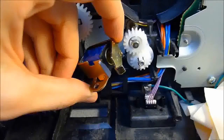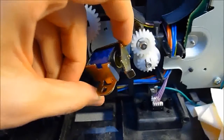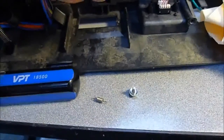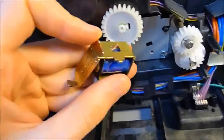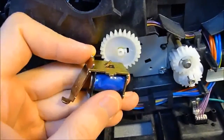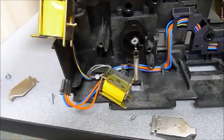As you can see, that's what it looks like with my little gray piece of electrical tape stuck on there. Now go ahead and put the spring and the screw back into the solenoid and hook it back in. Be very careful when putting the spring back on — I would suggest doing it from this angle, otherwise that spring is going to act like a rubber band and shoot off into the far corners of your office, which has already happened to me twice. So just be careful when hooking that back on.